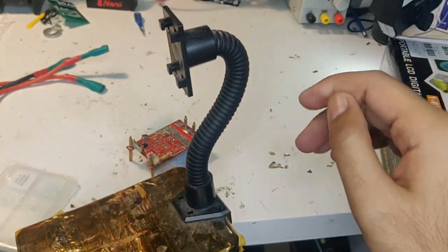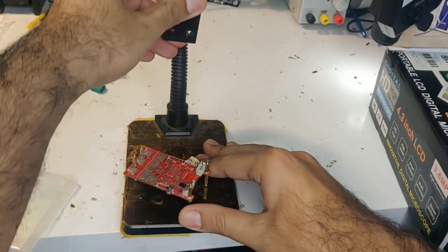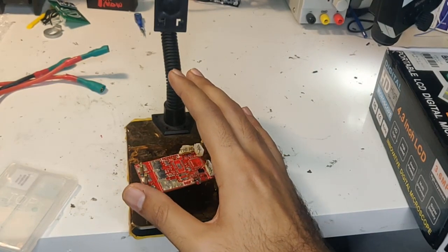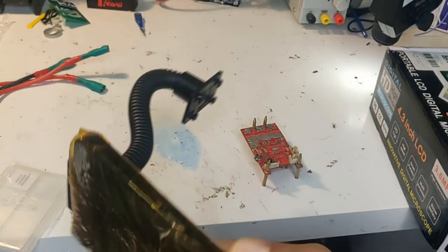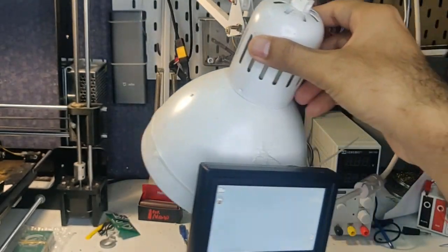That's how the stand looks. It said it's metal but I'm not really sure, so I put some Kapton tape on it to prevent deformation during SMD soldering. The microscope mounts on the stand, which is pretty great because unlike the other microscope, this one is designed to be an electronics microscope. You put your PCB here and the microscope here, and you can move it in any direction - up, down, or sideways - which is much better than the rigid one-plane setup. However, I found an even better hack: I don't use the stand anymore. Instead I hot glued it and put zip ties on an IKEA lamp, so I can move it anywhere I want, and that has worked fantastically.